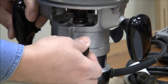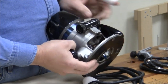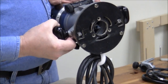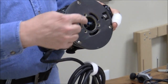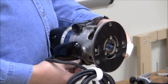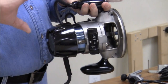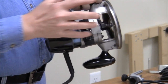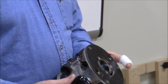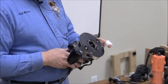This particular router uses what's called a rack and pinion — there are little teeth, and then there's a knob with a vernier adjustment to control the height of the motor in the base, which effectively controls how much the bit projects. It's a very workable scheme. Some routers instead use threads on the motor housing so that you twist the motor in the base to extend or retract it. But it also works well.